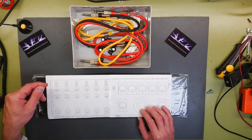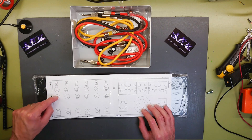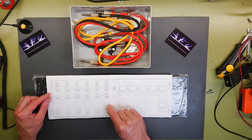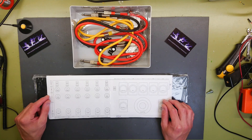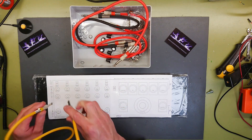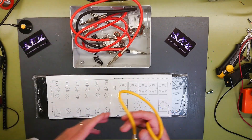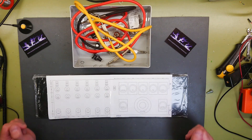The channel selectors are more like choosing to use the audio input into the analog interrupters — it's more of an enable. Now why do I put in two mono jacks for each? Because I said I could choose between playing one instrument on more coils, but actually I can only choose to override the outputs from the master interrupter and not select like one to three channels, so I did not make a matrix like that. What I can do is use regular audio cables — if you have an instrument going in here you can just plug that straight on from one jack to another, so they are just in parallel. With three or four cables I can get one or two instruments to play all six coils, which is pretty much what I want.